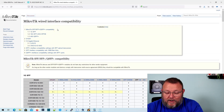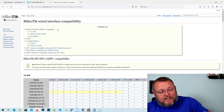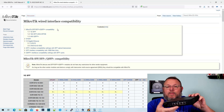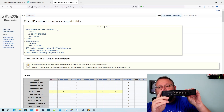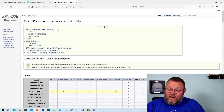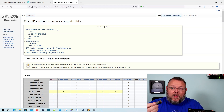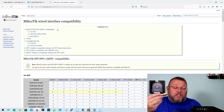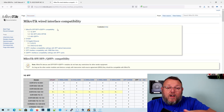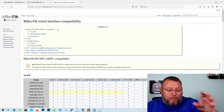I'm going to show you real world here. How am I using this, and how could you use this? Let's say you have a switch running into some devices and you want to uplink — say this QNAP 2.5 gig switch. It doesn't have SFPs, but it does have copper 2.5 gig ports. So if you've got a switch that has an SFP Plus, you take this, plug it into the switch, and now you have a 2.5 gig uplink. It also works on 5 gig — I did test it with a Cambium switch with a 5 gig uplink and it worked just fine.